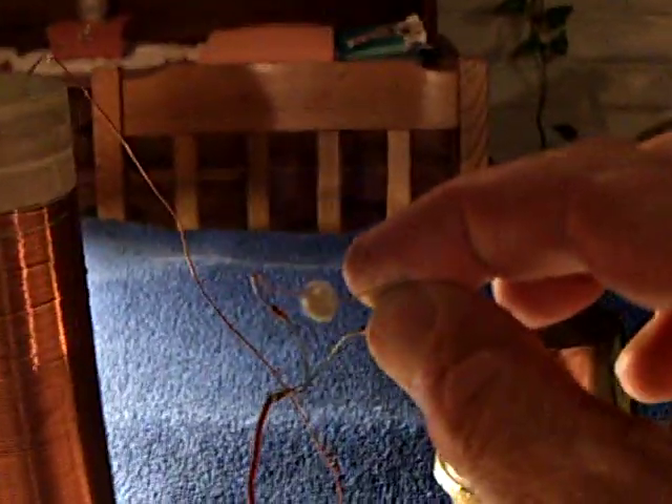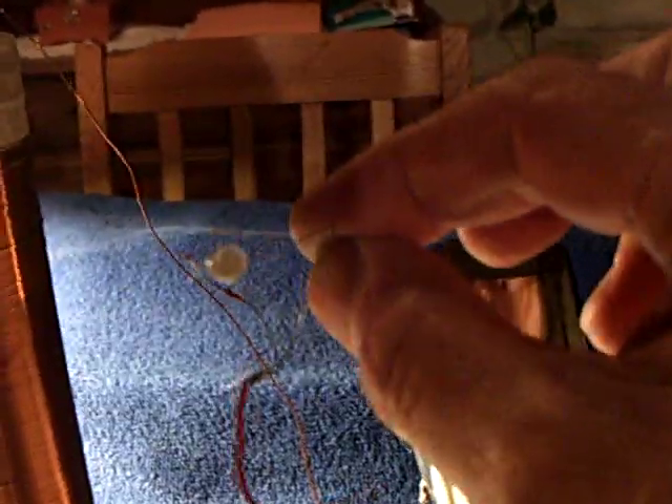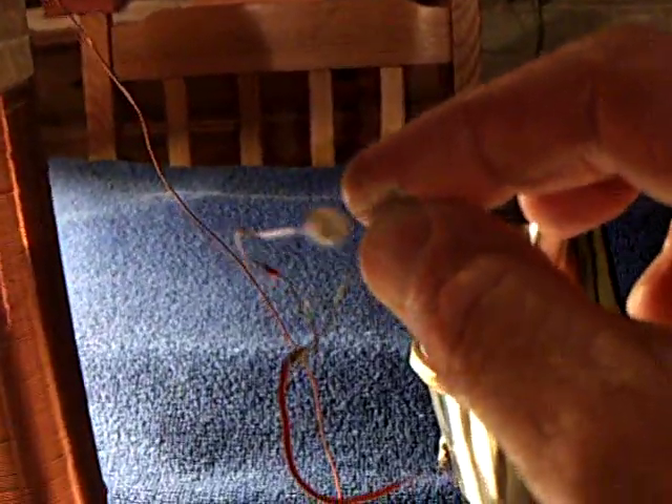The way you can tell it's running is it's actually in a blink mode, and you can see this LED blinking out in space here. This is in a blinking mode. I've got a capacitor here to cause that to happen - the capacitor's charging up, discharging, firing off the circuit, and that's causing this LED to flash in mid-space.